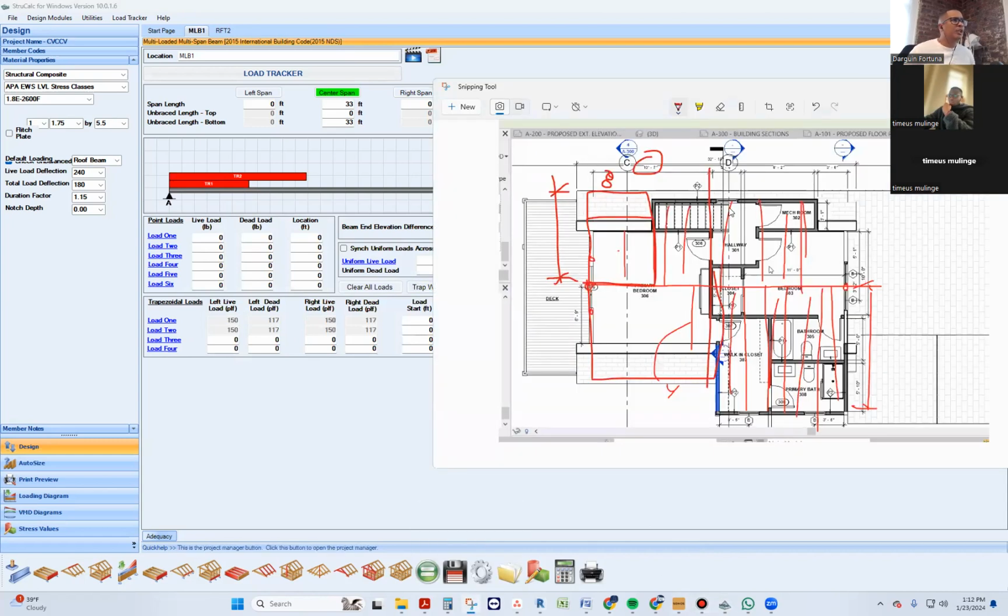Because they have to go the whole way. So now on the right side, I guess this is the right side, it starts right here and it ends right here. You have your dormer, right? One thing, just so you know, technically you should do it with another rafter that's going to have another slope, because your slope changed on that particular location. Does that make sense? That makes sense.